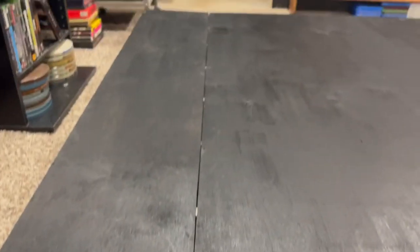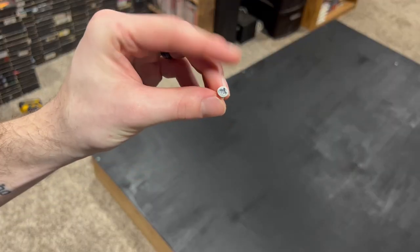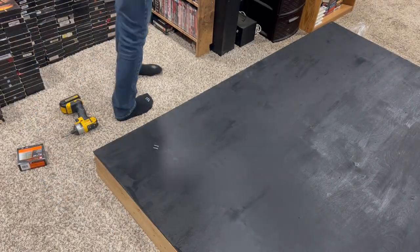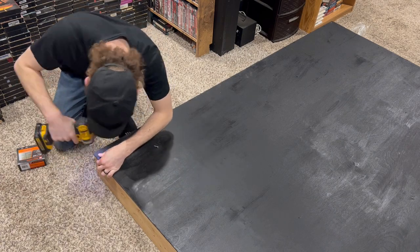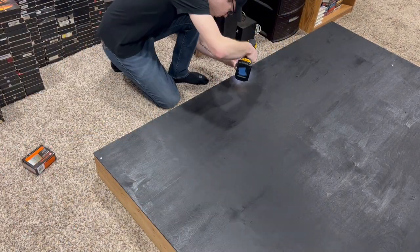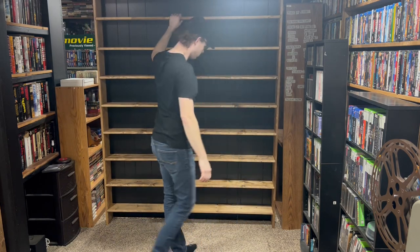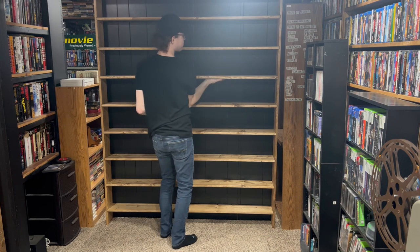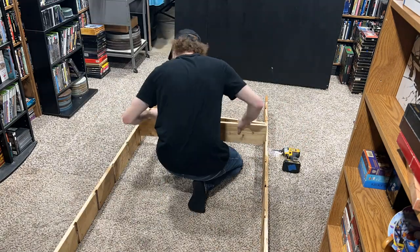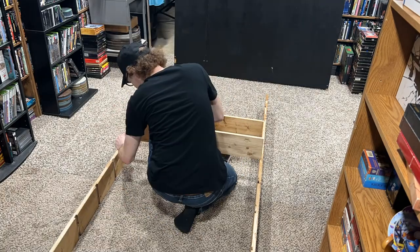As you can see, there is a small line in between the two pieces, which I knew was going to get covered up with movies anyway, so it didn't really matter. For this, I'm using just very tiny little almost thumbtack screws to basically hold the wood in place without going super deep into each board. I put at least one screw per corner and then one screw in between those, and then a couple towards the middle, just trying to make it as sturdy as possible. And then once that was built, I just made sure everything looked good and moved it out of the way because it was on to the second shelf — same process, just on a smaller scale, and just each board got two screws just like the other one.